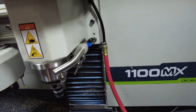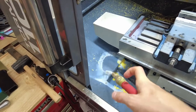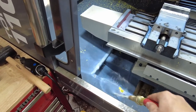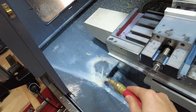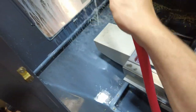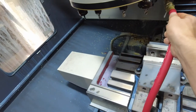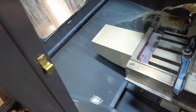I hijacked my spindle coolant and attached it to this little hose lead — I've just got a hose nozzle. I've found that the little hand trigger guns you see on a bigger machine like a Haas are too restrictive for the size of the Tormach coolant pump — it just doesn't have the pressure to push a lot through that. This nozzle is less restrictive and you get more volume. I don't have a lot of pressure but I do have quite a bit of flow, so if I can just get this washing over all the surfaces, it does wash everything down pretty well.